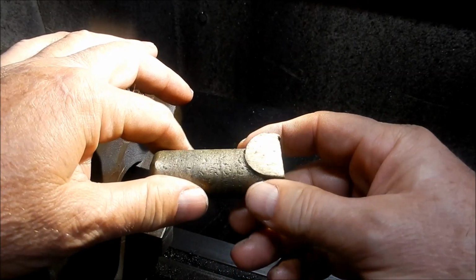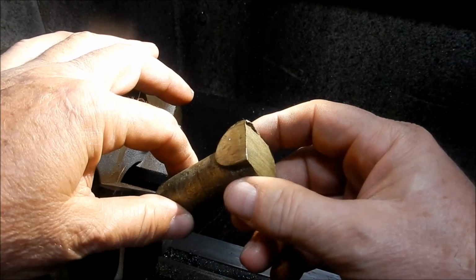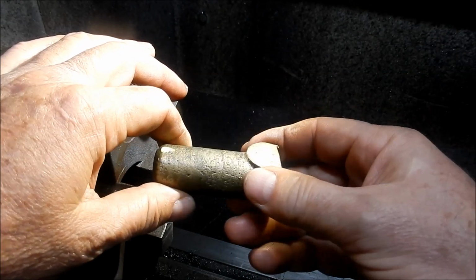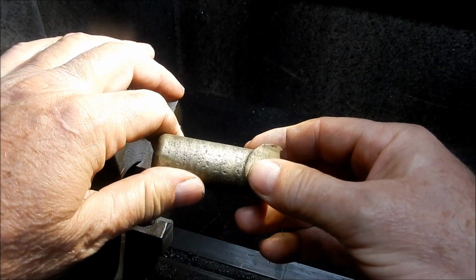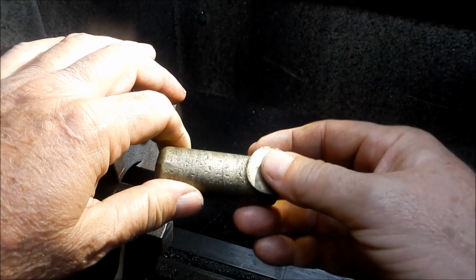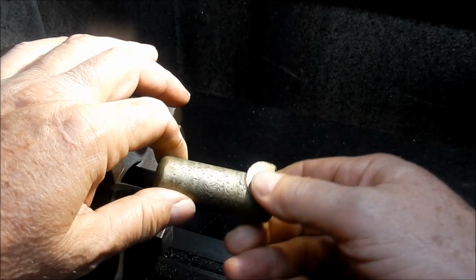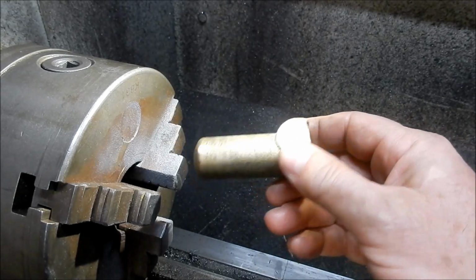When I was doing a lot of the cutter boat castings, chain plates and the masthead brackets for the stays, I did out of aluminium bronze because of the high tensile properties on that, but aluminium bronze is a horrible stuff to cast. It pours like porridge, poor definition, and shrinks like crazy. And on top of that, it's an absolute mongrel to machine. So, very hard and tough. I'd rather stick noodles in my eyeballs than machine this stuff. But anyway, it'll be ideal for our thrust washers. It's not going to deform when we apply pressure onto it. So, all right, we'll get set up in the three jaw, and we'll get these knocked out.